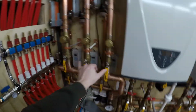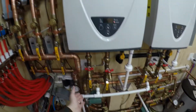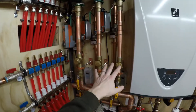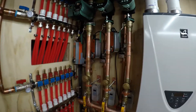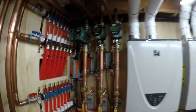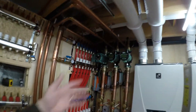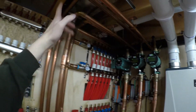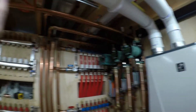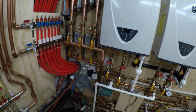There was really no way to put a three-way mixing valve in or temper the temperature down to these zones, so they're going to get whatever they get — whether it's 120 or 130 — and it'll be up to the return temperature and these aquastats to dial it in, which I'm pretty sure I can do fairly easily. As far as plumbing goes, I probably have a couple dozen joints left at one inch and then I'm done soldering on this project.